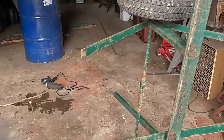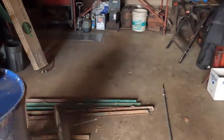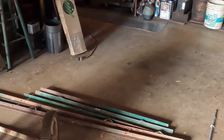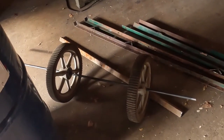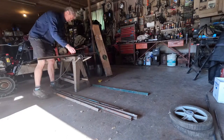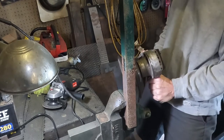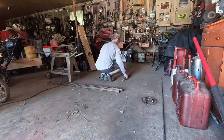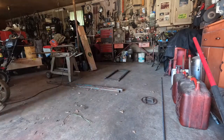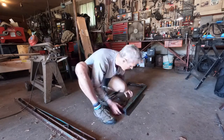We've got our little cart disassembled and I've got what I need off of it. Here's our drum and our pieces. I'm going to start making a frame from the bottom that will support our wheels. With measurements in mind I'm using the bandsaw to chop up the angle iron, then coming over to the bench and using the vise to clean it up. I've got a wire brush to remove the rust since we're upcycling, and I'm starting from the very bottom of the smoker — the barrel will ultimately sit on top of this frame.